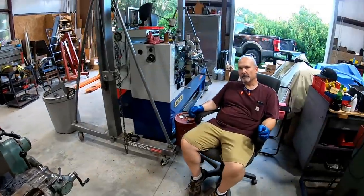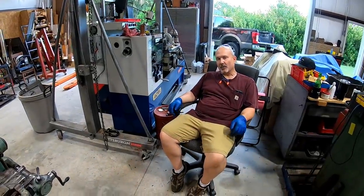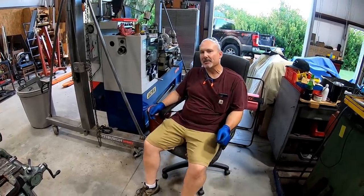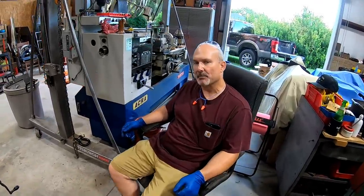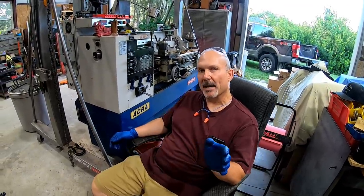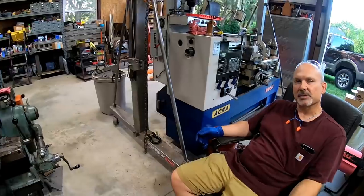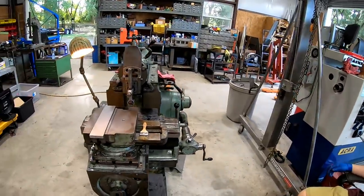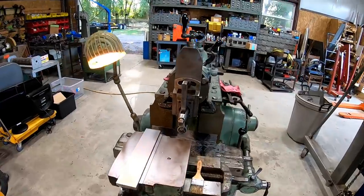We're just kind of shouting out our own theories of what may be happening. Yeah, we're all brilliant in our own minds. Yeah. But I think Adam may be onto something. I think the ram probably has some wear in it. Yeah. And we just don't have the stability the further we come out with that cut. Yeah. I think there's some just natural variation based on ram wear. And we know we have a little vibration in the machine. Yeah, so we got the vibration.